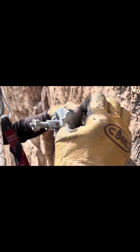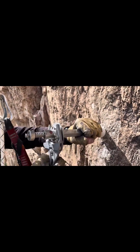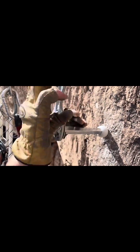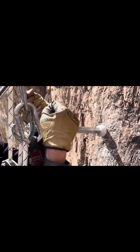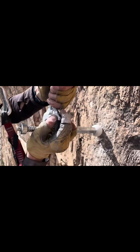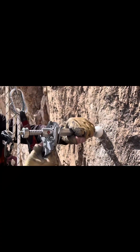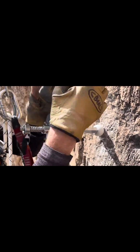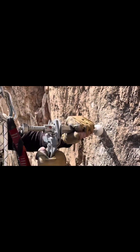Drilling that hole along the top saves a lot of time and a lot of battery, but it's probably only a good idea if you're going to use a glue-in replacement, because there's no way you're going to get a clean half-inch pristine hole at the end of this. This was a three-eighths bolt and we drilled a quarter inch beside it — so that's a negatory for reuse — but it's going to come out.